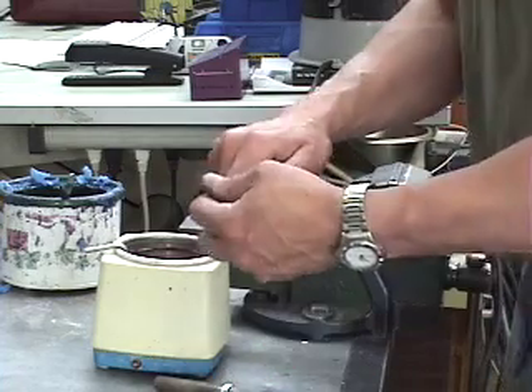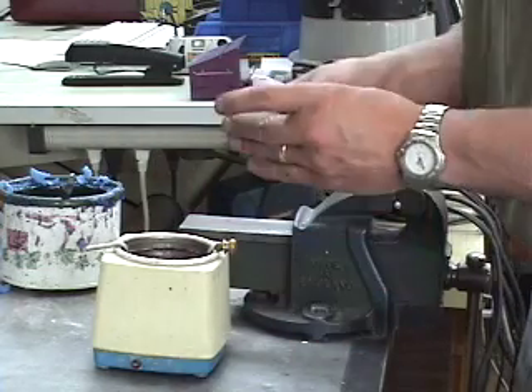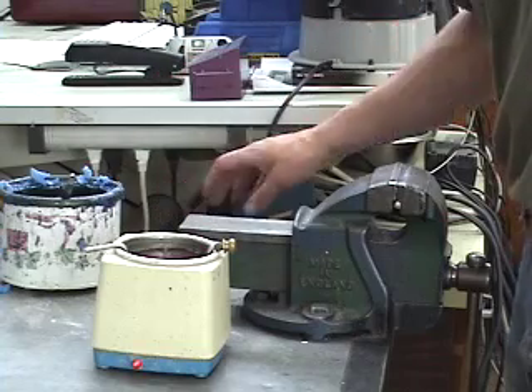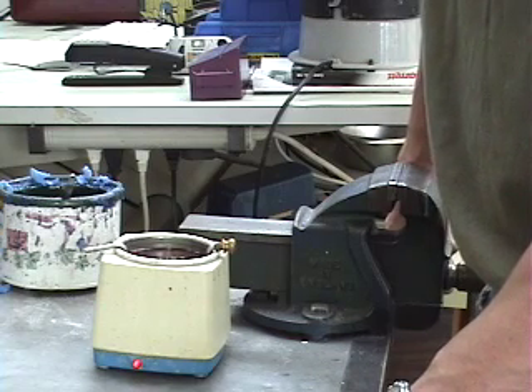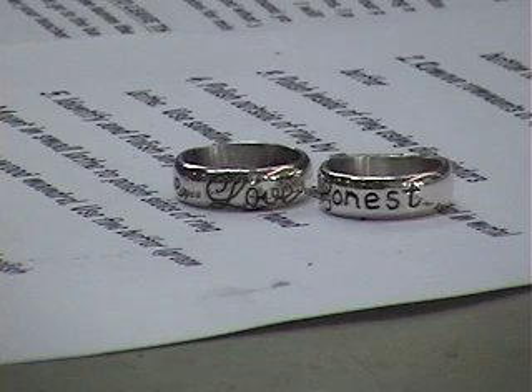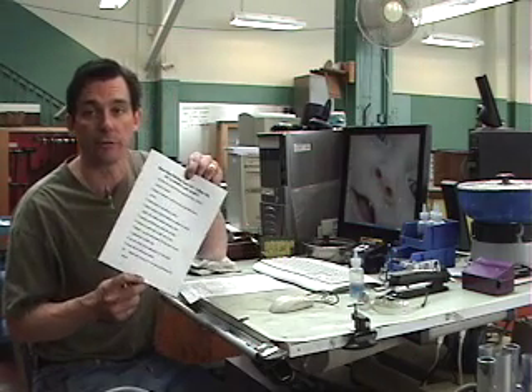The last thing I need to do is remove them off the mandrel. You'll notice that the polishing process leaves a dark residue on the surface, so we have to clean them. I put them in the ultrasonic cleaner and turn the switch on. For about 10 minutes it should ultrasonically scrub all the nooks and crevices of the rings and keep them nice and clean. Here you can see they're all cleaned up and finished. I like to darken the lettering — I find it looks better. There are a couple of imperfections on these rings, but I'm not going to worry about them. Sometimes these rings don't turn out perfect and you can still get a good mark, provided you follow these steps. The last thing you need to do is get a mark for your projects — that can be done by coming up and seeing me. Make sure you keep your handout or notes back in your journal so that next time you make a band it'll be quick and easy to do.